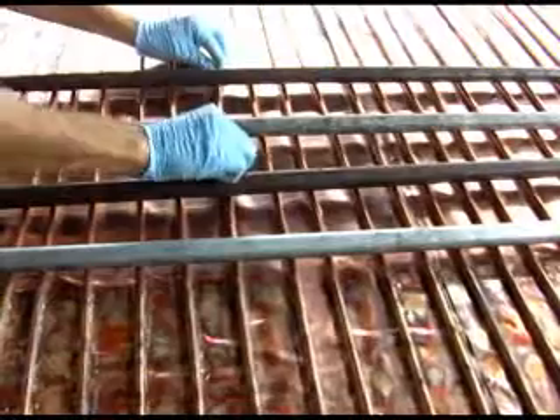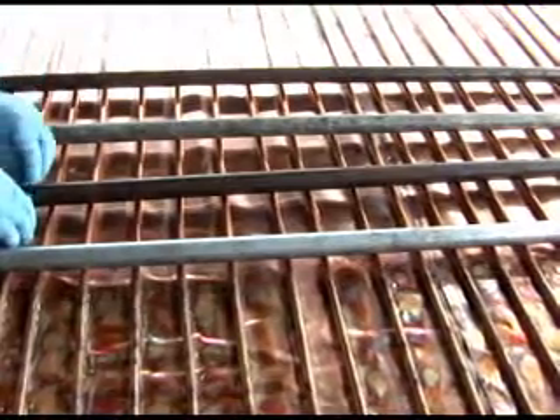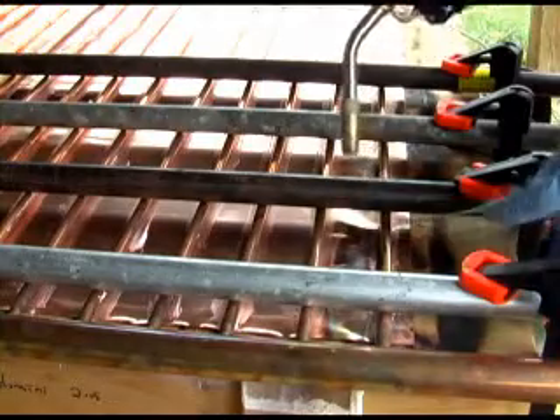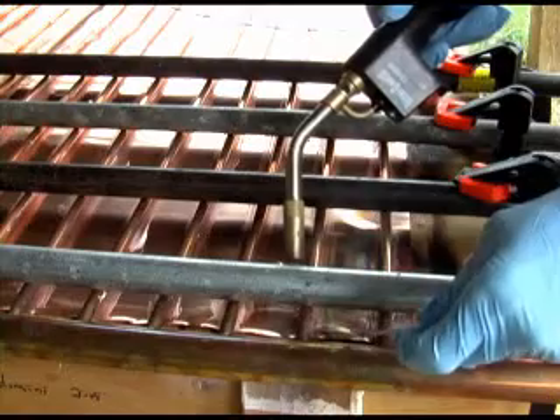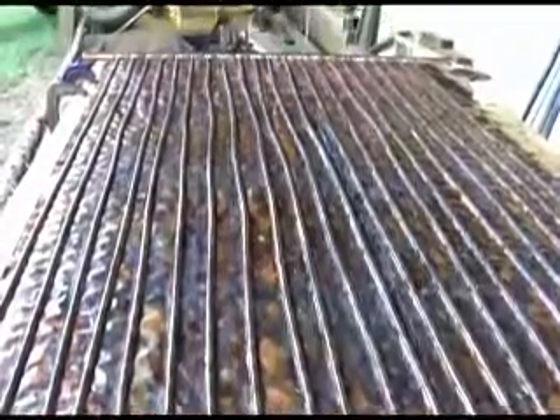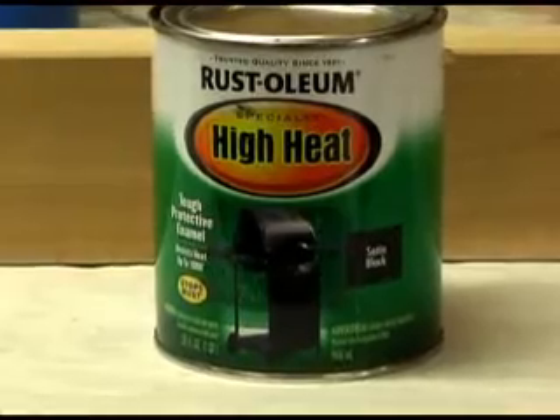At this point you can straighten the copper tubes that are wedged between the black iron pipes. You will spend about an hour soldering the copper sheet to the pipes. The soldering process causes the copper to ripple — this is fine. The other side of the sheet is the face of the panel. I sandblasted the face of the panel to roughen up the surface for painting. I used Rustoleum high temperature paint without a primer and sprayed the face of these panels. I let the panels hang in the basement for about a month to let them off-gas before putting them into the boxes.